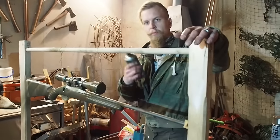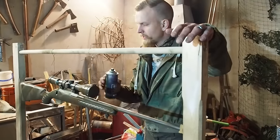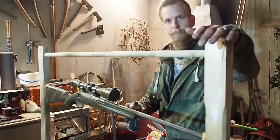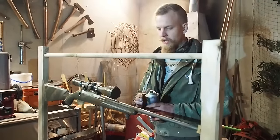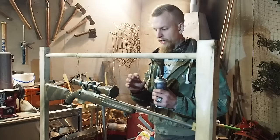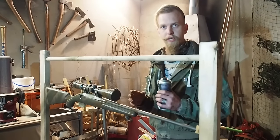When painting with spray cans or any type of spray gun, you have to use a slick motion across the whole workpiece. You have to start before the workpiece and end after it, because if you start or stop on the workpiece you will get much more color in one spot than another and it will not look even.